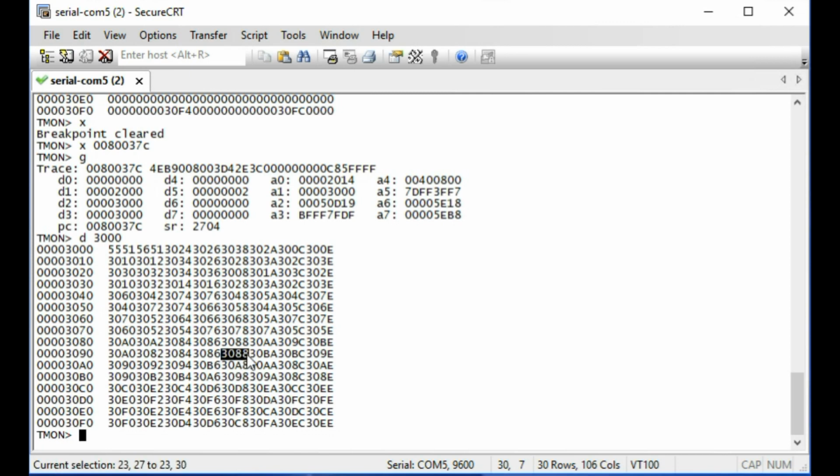3088 is in the wrong place and also in the right place. These things are just all jumbled up. And the reason you're seeing duplicates is probably that it had to execute many passes to load these up, and it's kind of permuting them around in the wrong places. But one thing that's interesting to note is that the lower bit is always right.